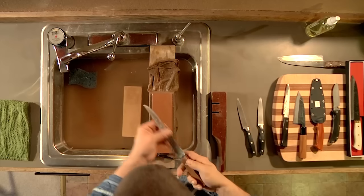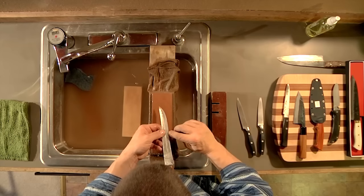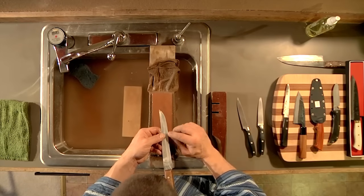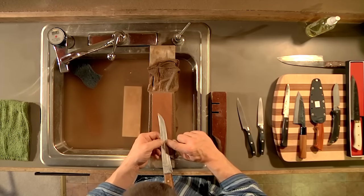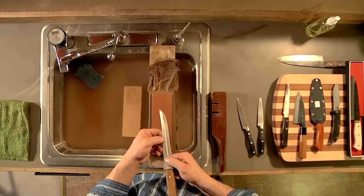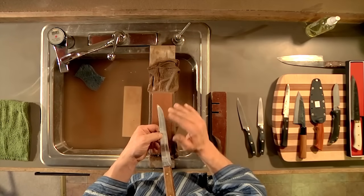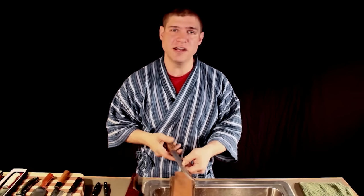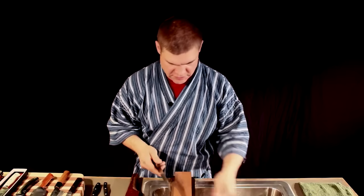Now, on some blades, you might want to remove more material down right towards the primary edge, just behind the primary edge. And on some knives, you might want to increase this line that's between my 2 fingers. You might want to raise it up higher, thereby giving the whole blade a thinner and a more acute profile. Again, that comes with experience, but remember, always the thinner, the better, but to the point where it has to withstand repeated use and abuse.